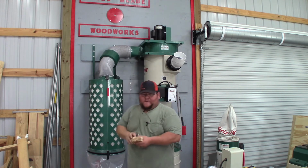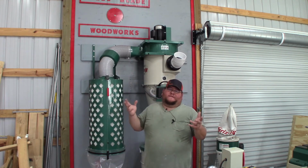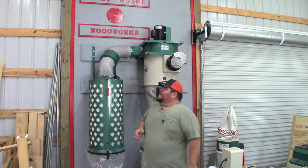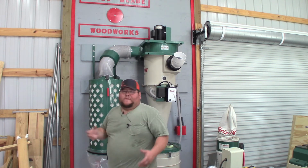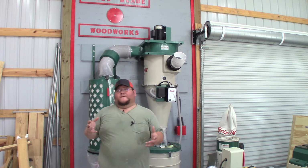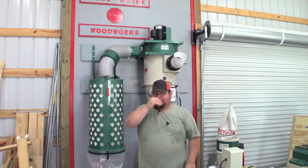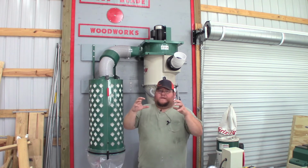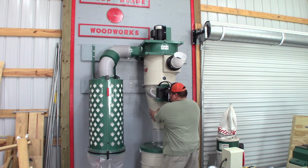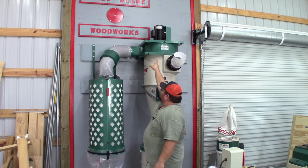If you're gonna go into an existing wall, I would make sure, I mean, the instructions say you can. They do stress that you need to make sure it's a good built wall to support that weight. It's heavy. Will it pull it down? I don't know. That might be an option if you're in a garage where you can bust the sheetrock off and get to it and just do some modifications maybe, and then re-sheetrock it. That's an option, just to make sure that your wall is rigid to hold it. This bottom board really is just to keep this Cyclone from swaying in and out. It really does not hold no weight. The weight is supported up there on this fan housing.